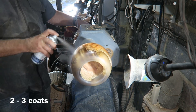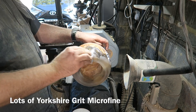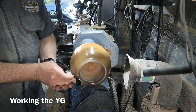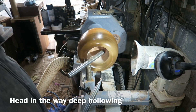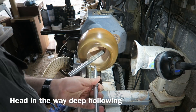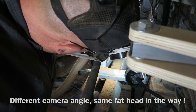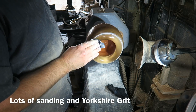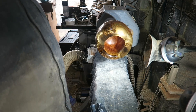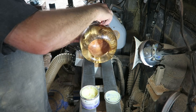So we're back on the lathe — quite a bit more sanding, then some sanding sealer, and then Yorkshire Grit Microfine. Loads of it — working it and working it to get this lovely lustre on the wood and the resin. And then it's time to do some deep hollowing — this is special head-in-the-way hollowing. I managed to mess up a lot of footage with my head in the way, but there wasn't much to see anyway. Then more sanding and Yorkshire Grit until I get it to the state I'm happy with. And as you can see it's beginning to look good. A bit of Chestnut microcrystalline wax just to protect the wood when I do the next stage.